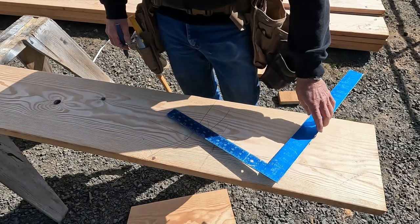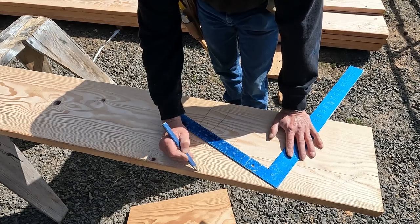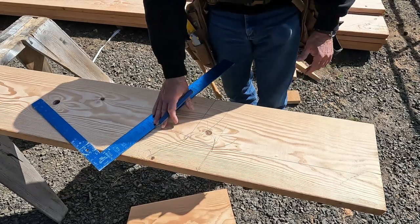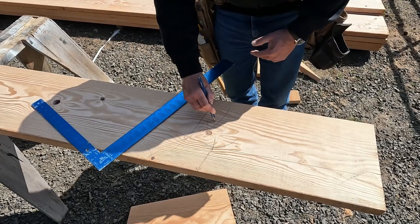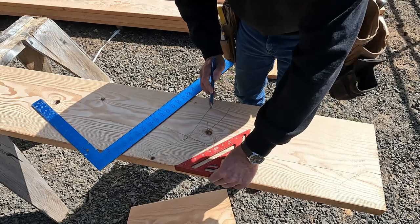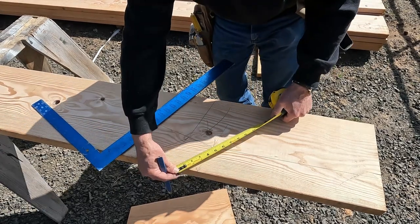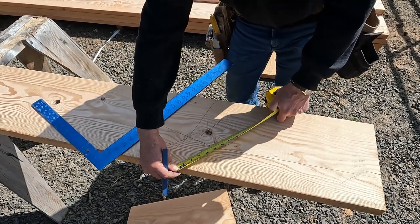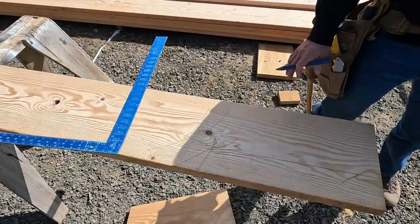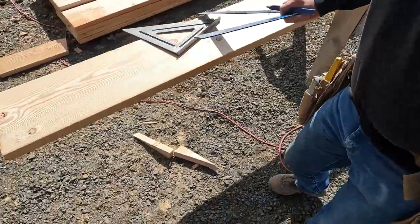When figuring your height on your beam or ledger, this is where you're measuring to — that's where the three and a half inches comes into play. Your beam is 12 inches, so if you've got your posts up and want to cut them off at the right height, you have to add in the beam and then add in that three and a half inches. Now if you're doing a steep pitch like a 12/12 — a 45-degree — you'd need to add about four and seven-eighths instead of the three and a half you use on a 3/12. Most framers have a framing square laying around, so I'll show you that method too.